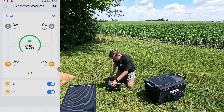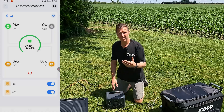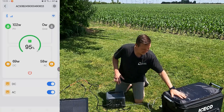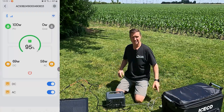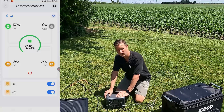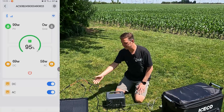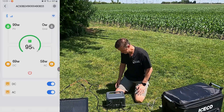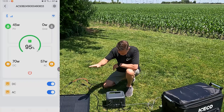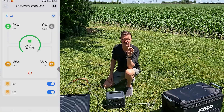Let's go ahead and plug in the solar panel and start giving it some juice. The PV output is starting to go up. It's partly cloudy so we will get some intermittent shading, but hopefully it will handle everything. Look at that — we're getting 101 watts out of this flexible solar panel! It's a 100-watt panel and it's actually overproducing, just laying flat on the ground. Right now we're at 99 watts. Watch what happens when I put a little bit of shade on one section — it drops all the way down to 45 to 50 watts. That's how much shading just wipes out solar panels.